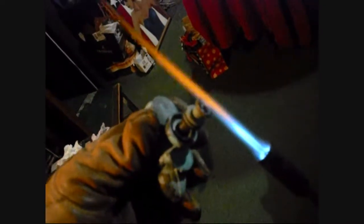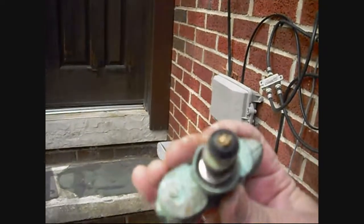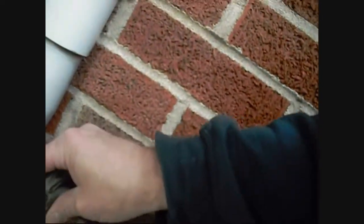When you try to unscrew it, it gets more worn and breaks off. So here I had to pick out the washer and then apply some torch heat. That loosens the sediments around the screw. Then very carefully take some pliers and unscrew the screw out of the stem. Be careful not to damage the brass cup that holds the washer. If the screw has no head, use smaller pliers, heat it up well, and turn it lefty loosey — very gently. It should come out. If it doesn't, you might as well replace the faucet entirely.